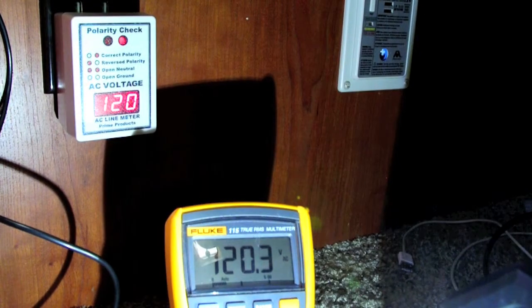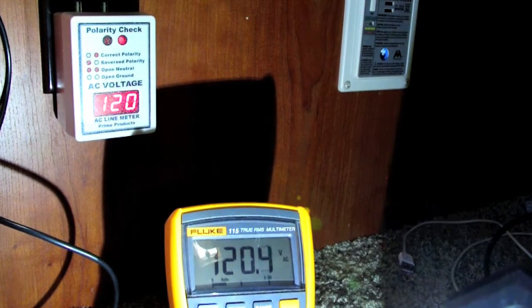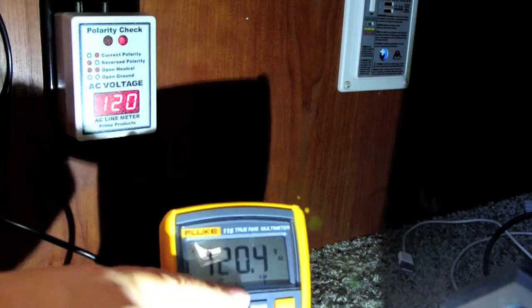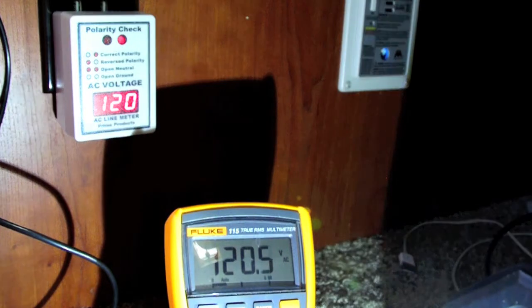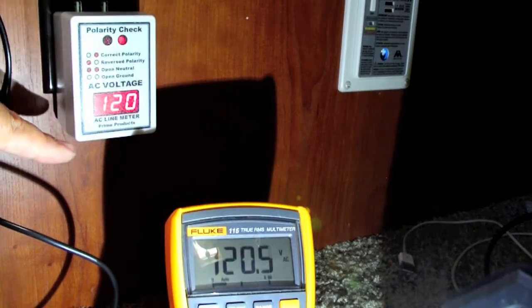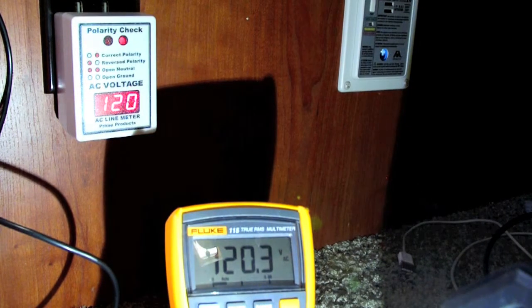Sometimes analog meters are not quite as accurate as digital meters. One thing an analog meter will give you is transients, where a digital meter is just too slow to respond to those. Sophisticated meters like this Fluke have a peak meter — a little bar graph along the bottom — and it does a better job showing transients. You shouldn't really see any transients if you're using a surge suppressor. If the reading is fluctuating constantly from 0 to 1, it's probably not a transient — it's likely just that the voltage is somewhere in between, which is the hysteresis error I was describing.